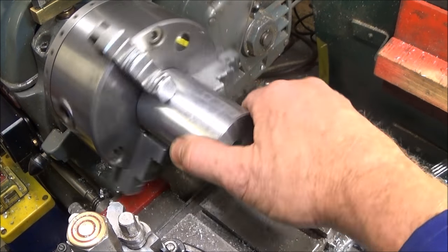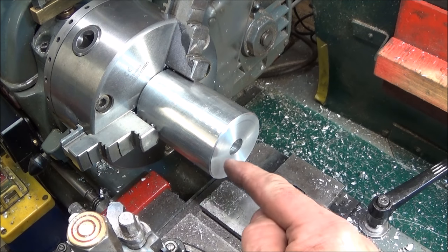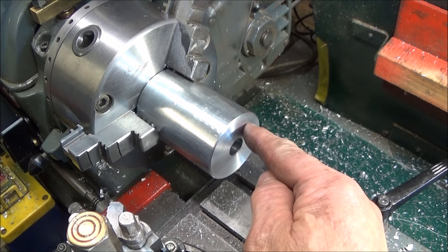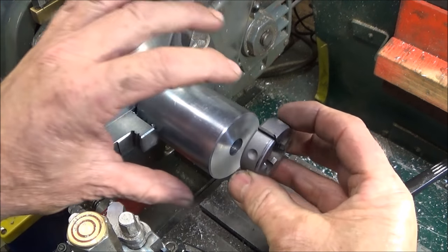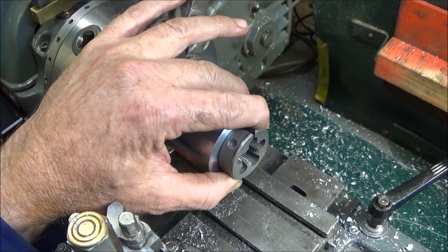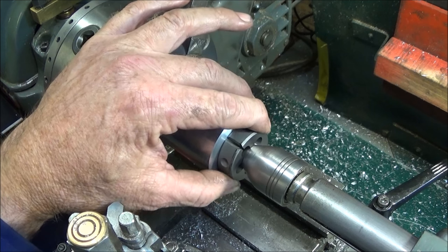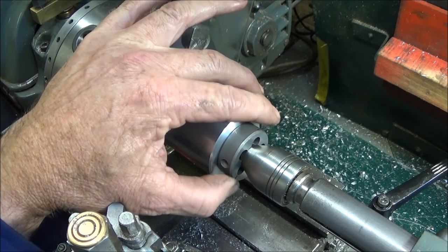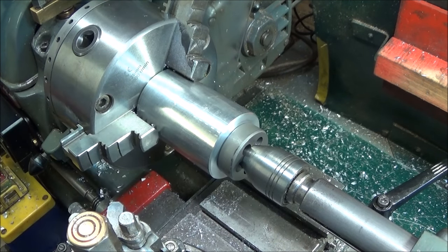So after drilling, leave the component in the jaws. Don't take it out. It's all nicely clocked in. And I've got a little trick that I've learnt recently to speed up the actual rough boring operation. In this case, obviously, it's for the die. So I put the die on the front face of the job like that, put a large live centre into that. And you can do this with any type of component you're boring a piece out for.